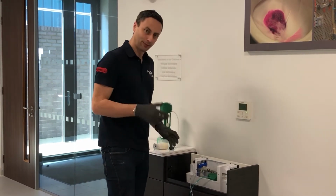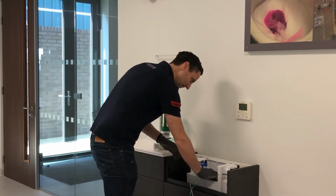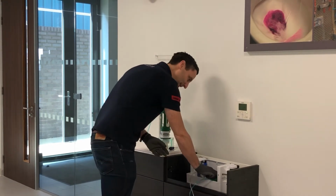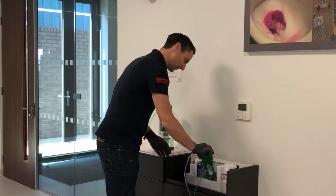It's not critical, but what is going to happen is when you remove that flush valve, it will constantly fill. So, to remove the flush valve, it's very much like a bayonet fitting in a light bulb. You twist to unlock and release, and once you've released that flush valve, you can do some closer examination.